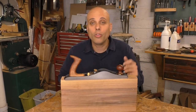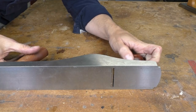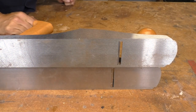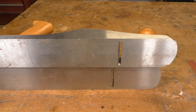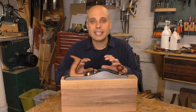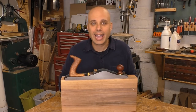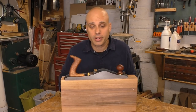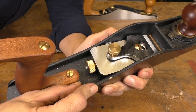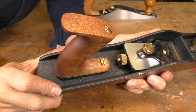This problem is already a deal breaker, but on top of that the mouth of the plane also doesn't open far enough. This right here is the maximum opening — about a sixteenth of an inch. Take a look at the Stanley: at maximum opening it's got more than twice the space the Tay does. This is another thing that should have been fixed in the design phase. Finally, I don't really like the fit and finish of the plane very much. It's decent overall and it's more traditional looking, which is going to appeal to some people who are turned off by the high-tech look of the Stanley or the Veritas. But unfortunately the powder coat they're using is already flaking off in several spots, and I can see where they had to touch it up at the factory. It's really clear that it's just not going to hold up long term.